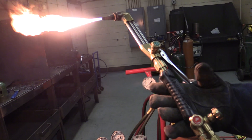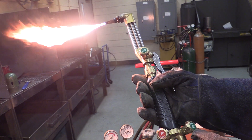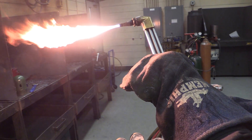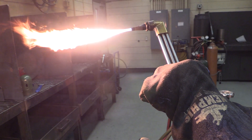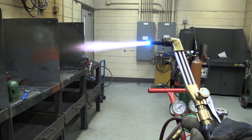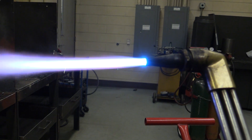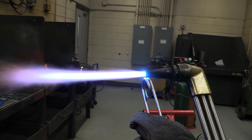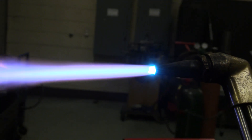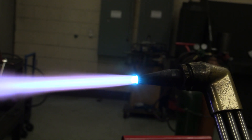Once I have my fuel gas set, I'm going to start adding oxygen — remember this one's already wide open, so this is our control. Now I'm going to slowly add oxygen in, turn it on very slow, and watch what happens to the flame. Now that's a nice neutral flame — you can see that it's not loud and screaming. Most importantly, those inner feathers of that flame are about a quarter of an inch off from the tip. I can turn it up a little — a little more gas, a little more oxygen — and now our flame is set.